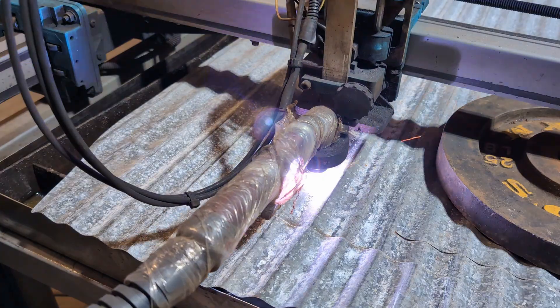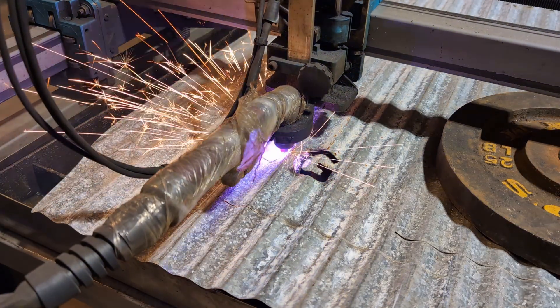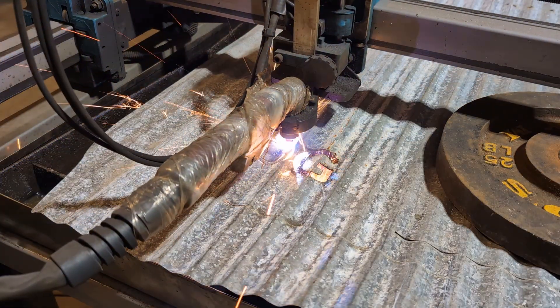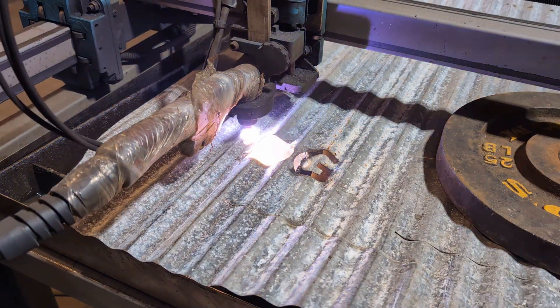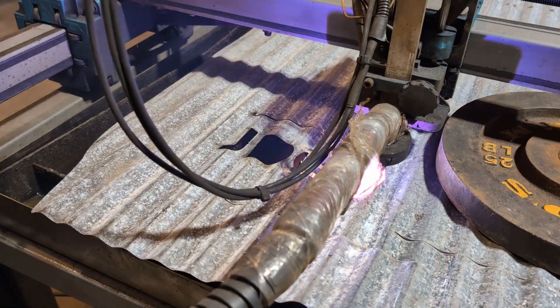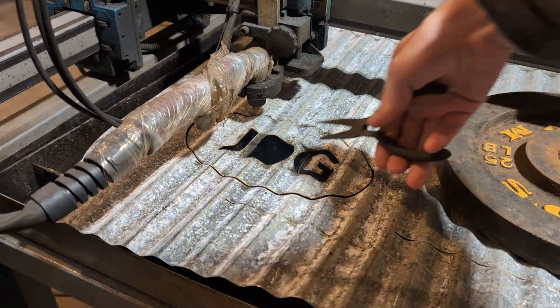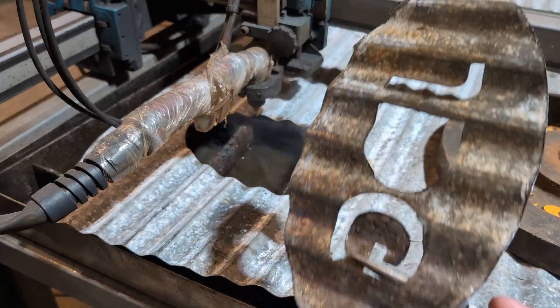As promised, I'll give a little update on our THC. We've had these out for testing with some customers for several weeks. The THC itself runs fantastic and our customers have had very good luck with it. We've had one little bug: if you try to power the THC with the same power source as the CNC, there can be some feedback through the ground causing scrambling. We decided to add some filtration to the THC to make sure it doesn't matter which power source it's hooked up to. That second step is being tested right now, and then we should be able to start manufacturing these and getting them ready for sale in the near future.